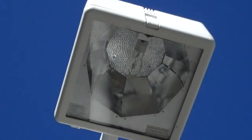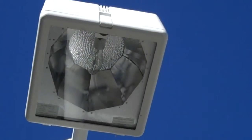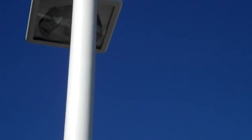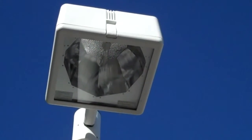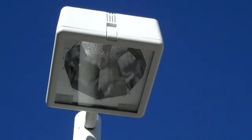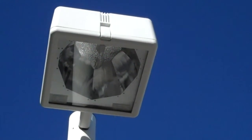These are 50-watt metal halide shoebox fixtures. We could change these to a compact fluorescent fixture, and that would be about half of the wattage — so we'd go to something like a 25-watt CFL. We might also be able to do a retrofit where we leave the fixture, because it's a nice fixture, and just change the guts on the inside.